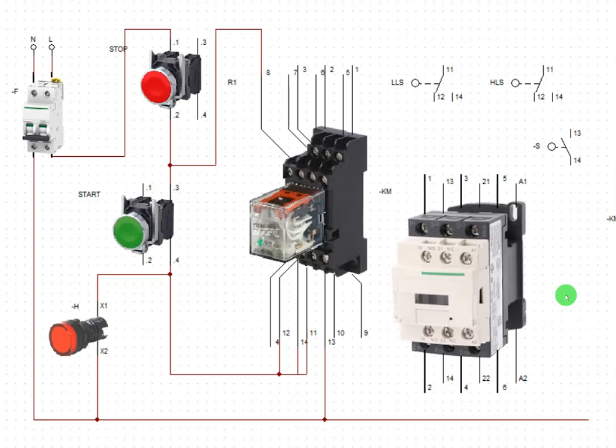Whether you are using a single phase motor or a three phase motor, the connection remains the same. That is, the control system here is the same. So let's concentrate on this based on single phase, because most of our submerged pumps for residential use are all single phase. But if you decide to use three phase, it's all the same.